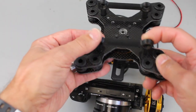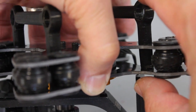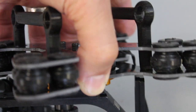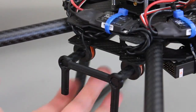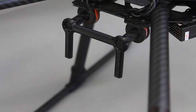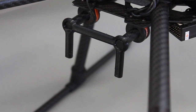So I designed and 3D printed these brackets. On the bottom of the design there's a little hole that I was able to screw into and get this nice and snug so that we could mount the gimbal. There are holes in the bottom and with those Tarot rods sticking out, you can see that it'll just slide on and mount to the undercarriage. After I get this in the air and verify everything works properly, I'll put these on Thingiverse for those of you with this gimbal setup who want to mount it to a Tarot without any drilling.